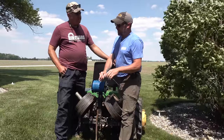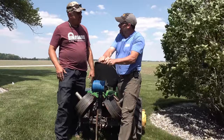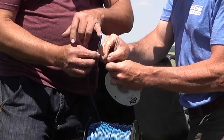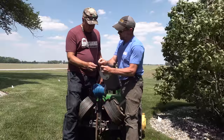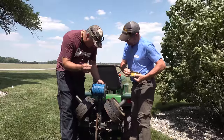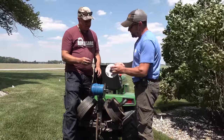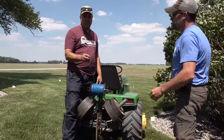How have you had a failure? The biggest failure here is our heavy clay-based soil. As it dries out in the summertime, it actually forms cracks and will grab onto the wire, stretching and pulling it apart — it'll actually break the light wire. Look at this comparison: not only is the wire diameter smaller with the kit wire, the insulation isn't even comparable — the upgrade wire has two to three times more insulation. You can find this as efencepro on Amazon. To me, it's just worth the extra money. It comes on a 500-foot spool — same as the kit wire, but the difference in size is remarkable. We'll put this on our Amazon store if you're interested.